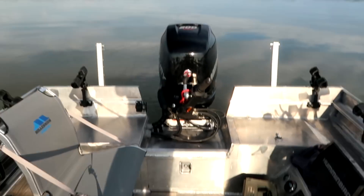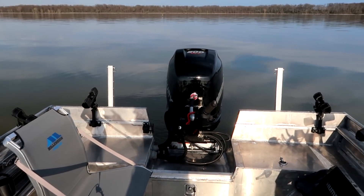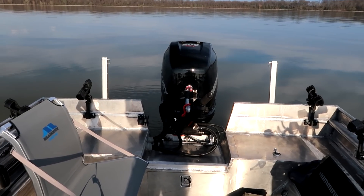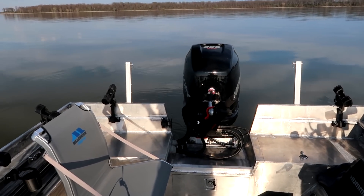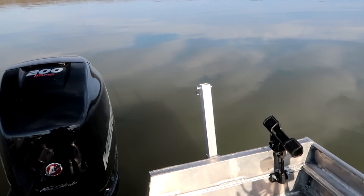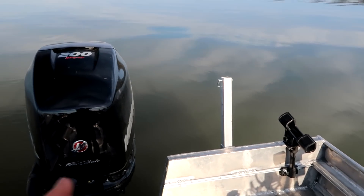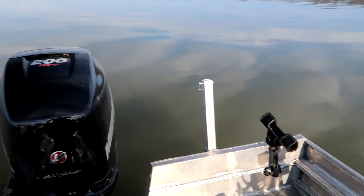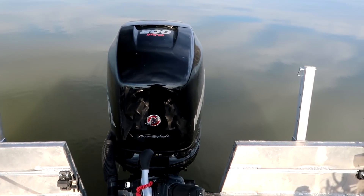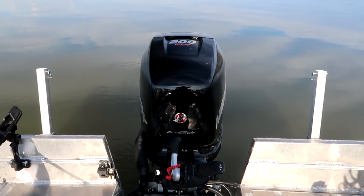You'll see a lot of stuff on the rails - I absolutely love the accessory rails that I put on here. I've got everything hanging off of them. Most of this stuff won't be permanent, but I've got everything laid out where it could be used in a fishing situation. Starting right back here at the end of the boat, these two sticks are basically drift paddles. That piece of two-inch tubing slides up and down with a 10-by-10-inch piece of plate at the bottom. This is going to slow me down at a trolling speed, because right now this boat runs at about 2.8 miles per hour at idle and that's too fast to troll without a kicker motor.